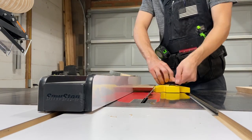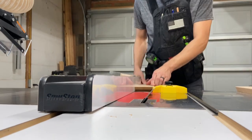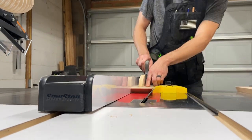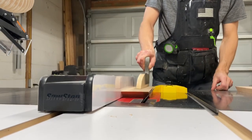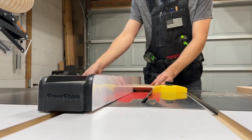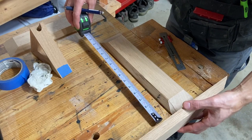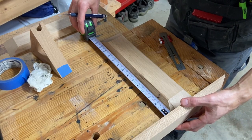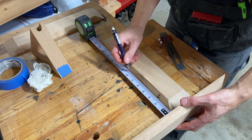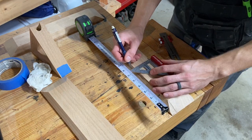Here I'm cutting the bevel on the front edge with my table saw blade set around 30 degrees, but this doesn't have to be anything specific — you can really play around with different angles and adjustments and just come up with something that looks good. I need to mark center on the bottom piece for the aluminum tube, so I use one of my side pieces as a straight edge, butting up the bottom piece to that and using it as a reference point for my tape measure.